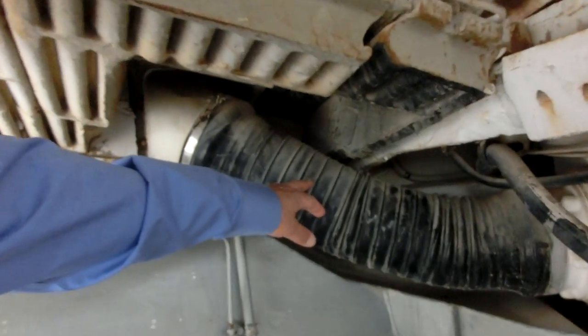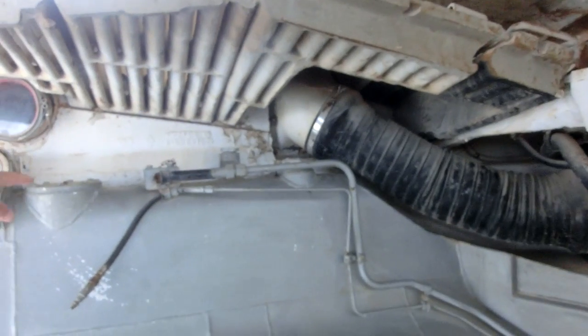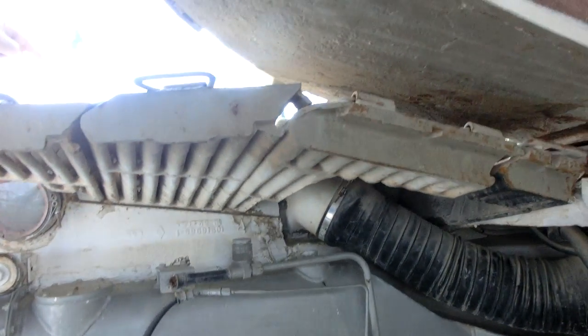Here is breathing air for the engine. It's coming from the turret, because when the tank fires, there's a lot of noxious gases inside the turret that can actually kill people. The air is taken from the inside of the turret into air filters that are just outside there.